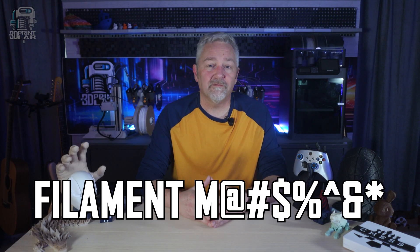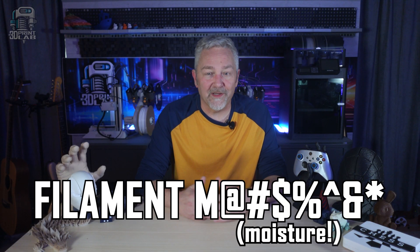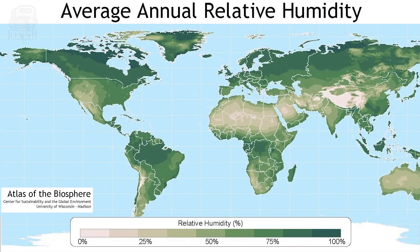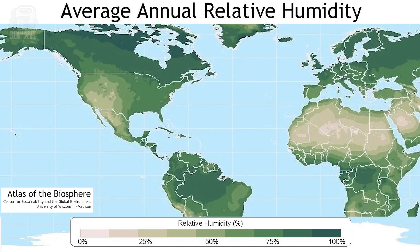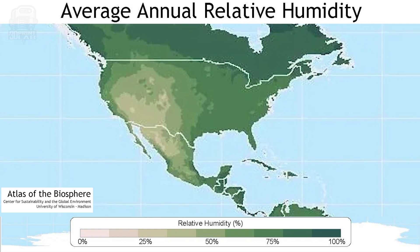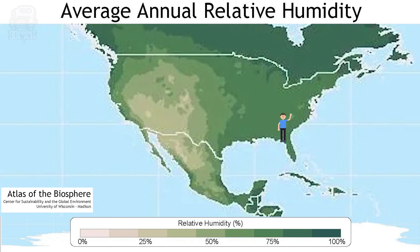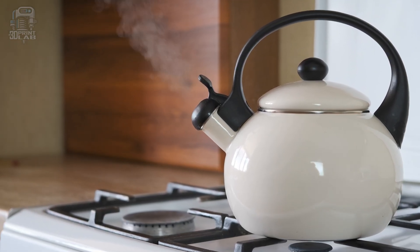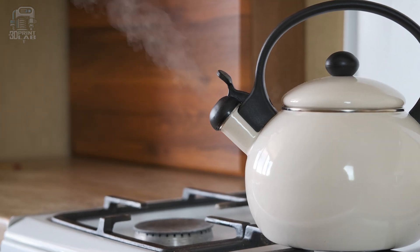You've probably heard at least a little bit about one of the biggest 3D printing debates, and that's regarding filament moisture. The biggest problem with this debate is that the most vocal critics and advocates don't seem to care or understand that people live in different humidity areas around the entire world — it can be a problem for some and not so much for others. The thing to remember is that water boils at 100 degrees Celsius and your filament extrudes somewhere around 200 degrees Celsius or more. So if you hear popping sounds as you extrude your filament, or it's brittle and snaps easily, that's when you know you probably have an issue.